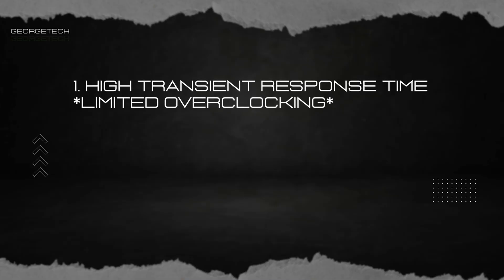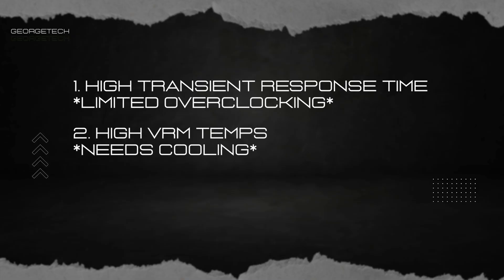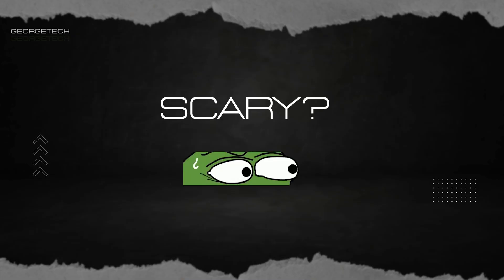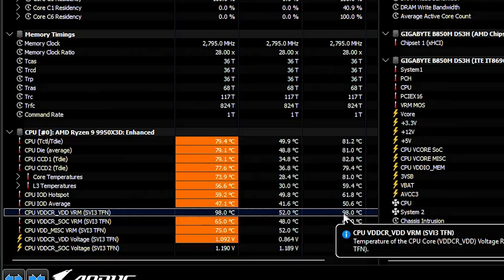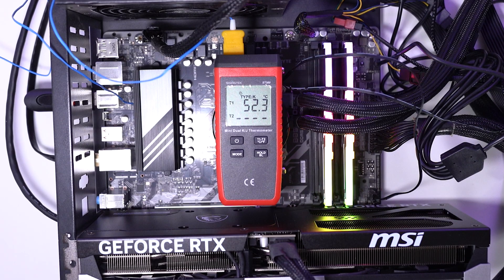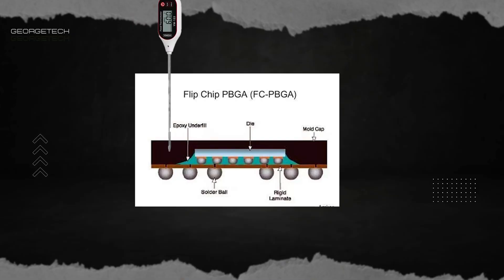So what are the drawbacks of using repeaters? Number one: higher transient response delay — in practice, overclocking will be limited. Number two: VRM temps will be higher. Should you be worried? Not really. AMD would not approve a board that doesn't follow spec. Running the 9950X3D, that VRM sensor shot up to 97°C during Cinebench, and clamps directly attached to the power stage were hitting 52°C. The temperature difference is due to flip chip design — the thermometer prongs sit on top, but all the heat is generated at the bottom. Hardware monitor software is your best friend for tracking this.